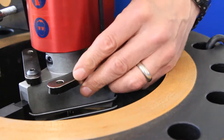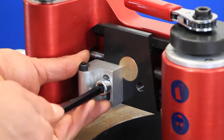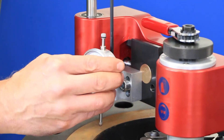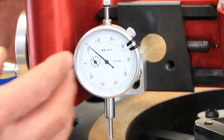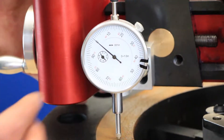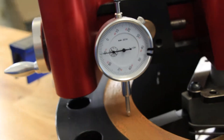Precisely squaring the FlangeHog to the surface of larger flanges is important to check due to flange size and torque requirements for smooth operation. To verify accurate alignment, attach the indicator bracket to the carriage using the same bolt used to mount the tool post assembly. When mounting the dial indicator to the bracket, be sure that the probe has clearance on both ends for an accurate reading. Once mounted, rotate the tool to find the low and high points and set the dial indicator to zero at the most positive reading.